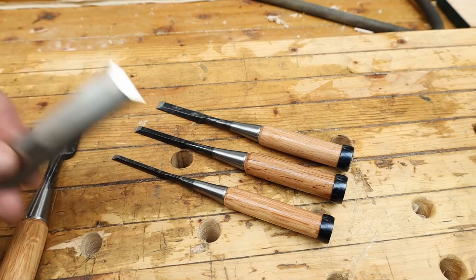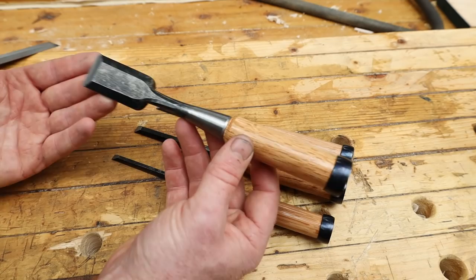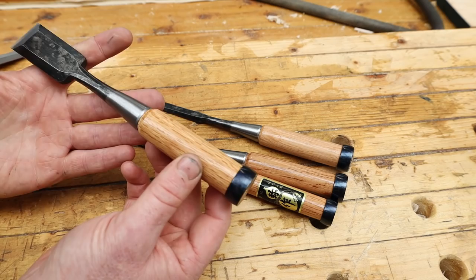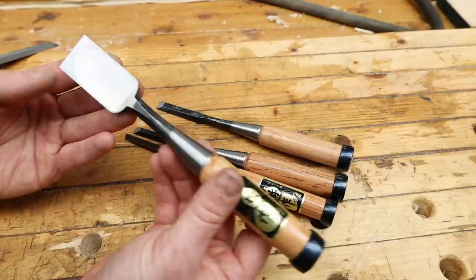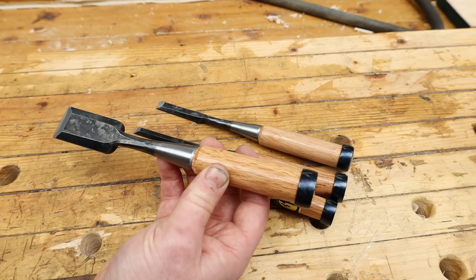Sharpening is much quicker because you have softer steel with hardened steel only at the cutting edge, unlike a western chisel which is entirely hardened steel — sharpening the full bevel takes a lot longer. There's also a difference in handle construction: there's a blue-steeled hoop on the end. Out of the box they are sharp, but not cutting-sharp for woodworking. We have to flatten the back, prepare the edge, and set the hoop.